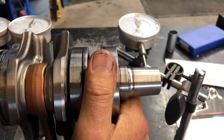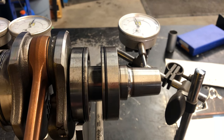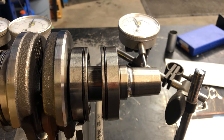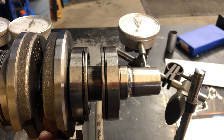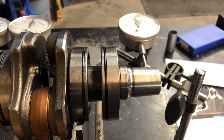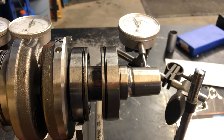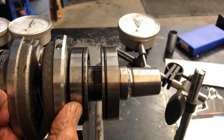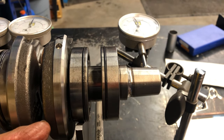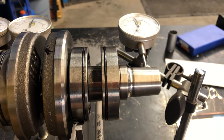The biggest out is the rotation, so I'm going to give it another little tap right there — I tapped a little harder than I wanted to, but we'll find out. Pin at the top, re-zeroed; pin at the bottom — zeroed. Basically the width of the needle. Rotation-wise, I'm good. Pin toward me: a little bit right of zero. Pin away: same amount the other way. So there's a little spread issue. I can see it move over when I pinch it with my fingers, so I'll give it a knock 180 degrees off.